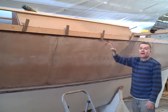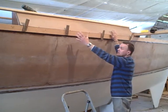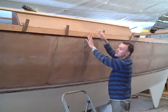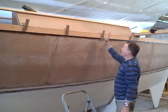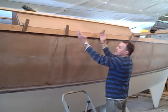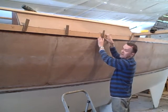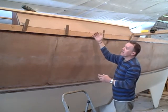The problem I had was trying to hold a piece of ply in place whilst putting pressure against it, to be able to mark this curve along here. And this was the first problem — getting it to fit along here. Last night I did try these pieces of temporary ply just screwed into place to hold the ply in position, but I made the mistake of screwing them tightly to the hull side stringer, so I'd got nowhere to mark.